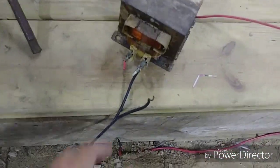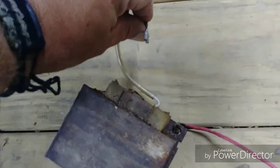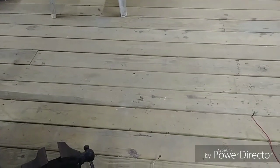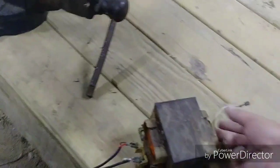In a nutshell, that's basically all you do for your fractal burning machine. This side hooks into your power, grounded off to the body, hooks to one side of where you want to burn. This goes straight to the transformer secondary coil and will go to the other side of where you want to burn. Use baking soda water - it works really well - unless you can find something else, because baking soda tends to darken the tannins in certain woods like poplar, oak, and cherry especially. Once that's done you give it a light sanding and you're good to go.